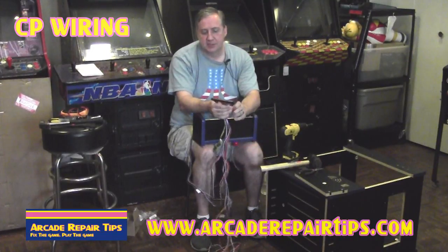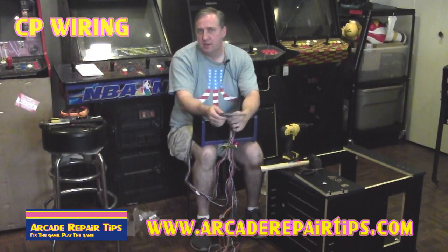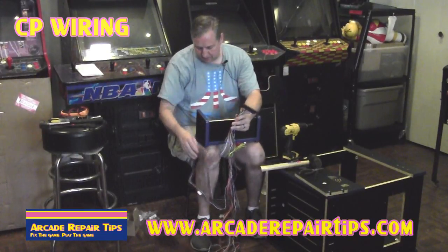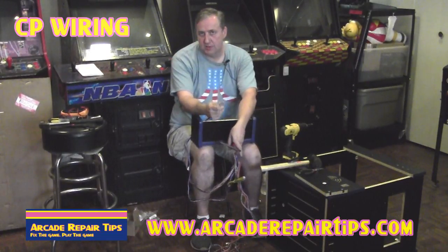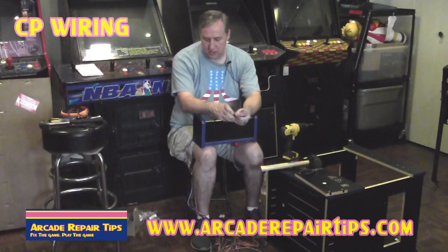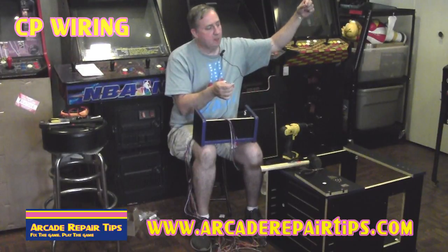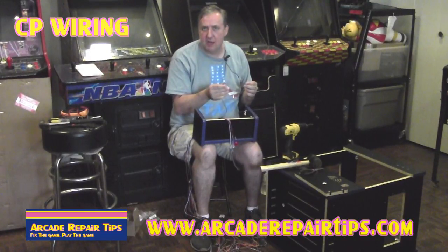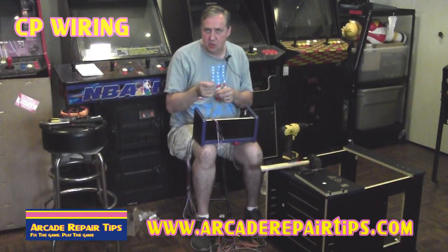It's all in English. So we will follow these wires, and what we did, we traced, it says player 1, you have one start, one left, one right, all those things, one button 1. We traced all that and found that that's this bundle of wires. Now also in our directions, it's color coded, so it tells us which wire goes to what. Then you have this thing, it's called a daisy chain of black wires, and about every 4 inches there's a connector. There's a reason for that. This is your grounds, and we're going to hook that up first, and it's going to go to each button. Now we'll zoom in and show you what we're talking about.